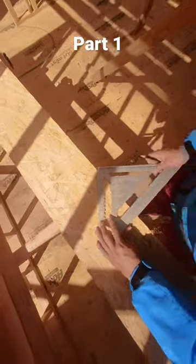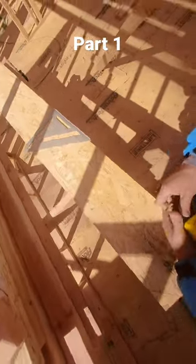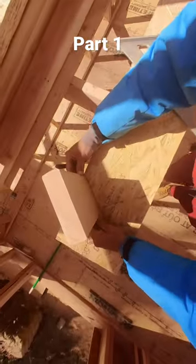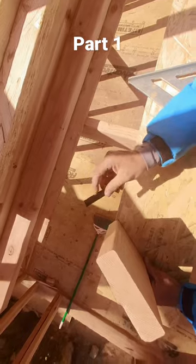I have five and a half here, so I'll trace it. For the tail, I'm going to use 10 and a half inches minus an inch and a half for the fascia. I'll use my speed square again at 10 pitch and trace it — this line here is my fascia. I'll pull right to the line, and the plywood is five-eighths exactly.